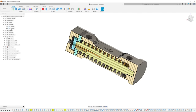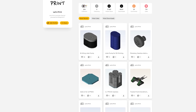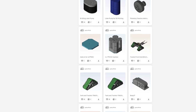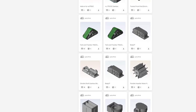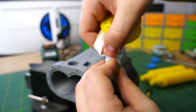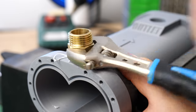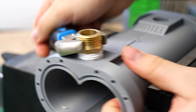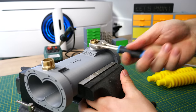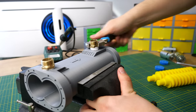For example, I didn't use any bearings for this project. All my models are always free to download, and I designed this pump so that you can build it without needing to order a lot of different non-3D printed things. The link for this model is down below. The first step is to screw hose nozzles to the pump housing. I didn't screw the nozzles straight to the pump — I first screwed in double-ended thread adapters, because if I later need to change the diameter of the nozzles, this way it's easier to do.